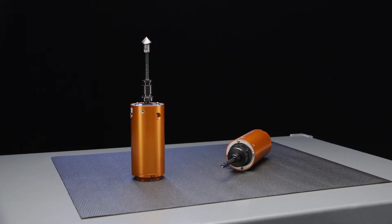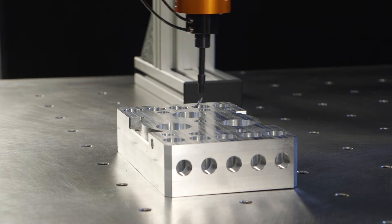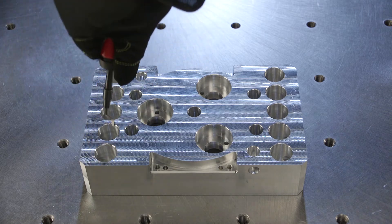You may be familiar with our motorized compliant tooling, which has been on the market since about 2005, but this tool is fairly different. So, what is the CDB? It's the first engineered tool on the market to add compliance to hand deburring blades. This utilizes ATI's trusted XY pivoting compliance and combines it with a hand tool every machinist is familiar with.